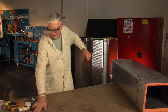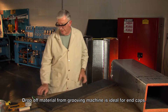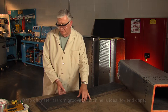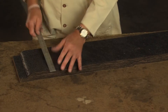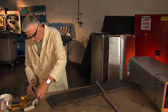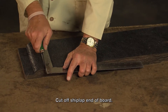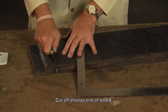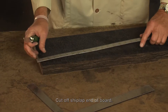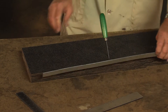I've taken advantage of having drop-off when we've grooved duct with the grooving machine, and I've run this board through the grooving machine to cut it down to nine and a half inches. First thing I'm going to do is cut off this end of the board. I'm going to come over 13 and a half inches — that's the 12 inches plus an inch and a half.